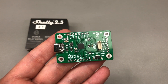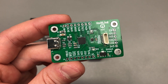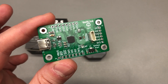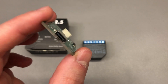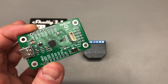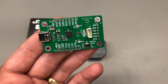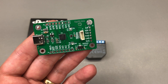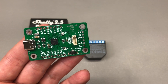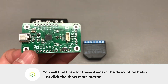You can use something like the Vollink USB to Serial Adapter, which is a product I sell on my Tindie store. This module has a built-in power supply capable of powering the Shelly relay while programming, so there is no need for it to be mains powered. It is a high quality USB to Serial Adapter with a USB Type-C port, capable of high baud rates for fast programming times, while providing up to 500mA at 3.3V to power any downstream device. The Vollink also provides automatic reset for ESP8266 and ESP32 devices, meaning there is no need to push or hold any buttons for reset and bootloader mode — everything is handled automatically.